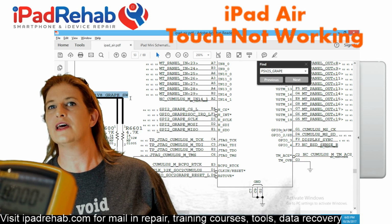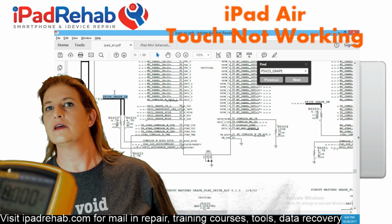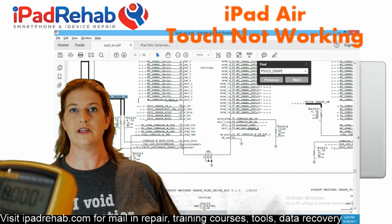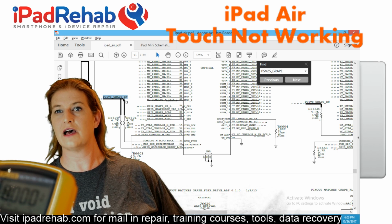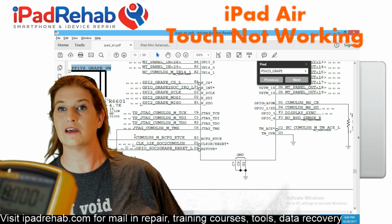Then we can look around here to see PP1V8 grape. Is that our line? PP1V8 grape SW. If that line, oh, here we go. Here's a problem right now. Uh-oh, I'm in trouble. Isn't PP1V8 grape SW the line that is down, or it was SW2? If this line is also down, then by definition, we're going to be missing these data lines.